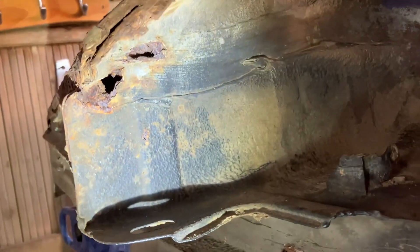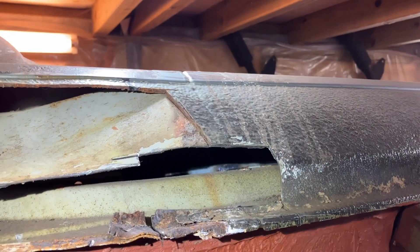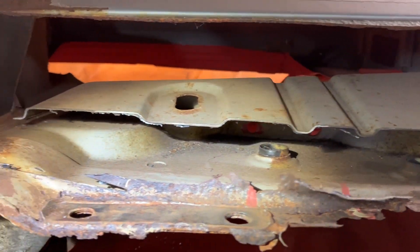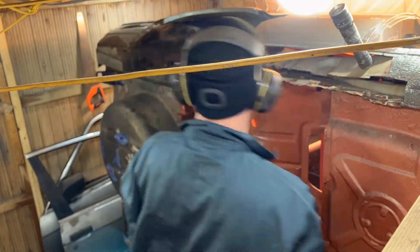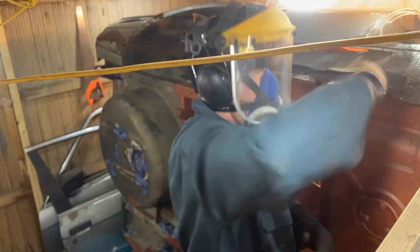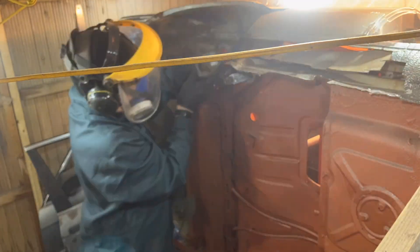The rear part I haven't really started cutting out, but that's not what this video is about. This is the outer sill, and this is a strengthening piece inside it, and it was rotten at the bottom where it meets the support for the rear beam. You can see the rust that got to it, so I'm just cleaning it up, taking out the spot welds to remove what's left of the rotten piece. Fortunately most of the piece that remained was in good condition.